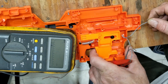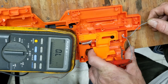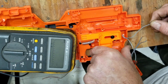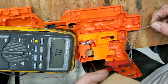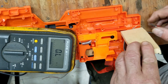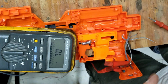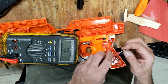It looks like about halfway is where I get continuity. So I'm gonna get a piece of wood — actually a piece of molding I had laying around — and shave that down and get it in there right about there, so the travel on this is stopped. That'll be nice and snappy. I'll probably hot melt glue it down in the bottom and that should make me a nice quick snappy trigger. The magic Dremel bailed me out again.